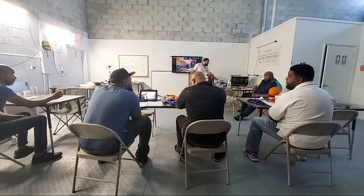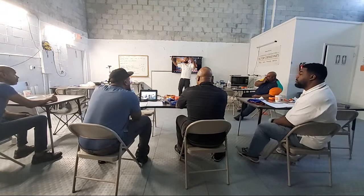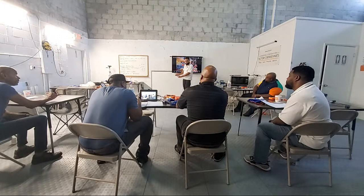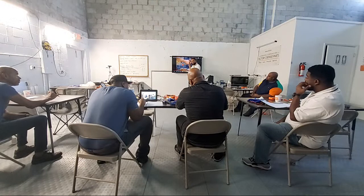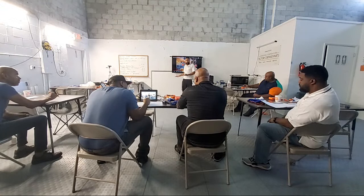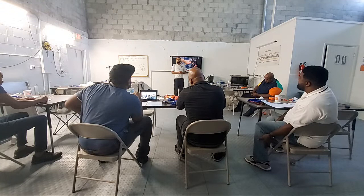We're going down a scenario, and the scenario is in a notebook, and I'm just walking you through some of the tests that we should do. We said, what are the signs if it had a defrost problem? What would it look like? We said the rear evaporator cover will be all snowy, frosty ice. And we said that air intrusion may mimic some of those signs, but it'll show a little bit more signs as well, like droplets of water on the top. You'll see frost over all of the food, that thin film of frost. You may want to check for air intrusion at that point. That's why I was showing you some of the points where air can enter the box. Did I answer your question? Yes. Okay, so we don't have a defrost. We don't have an evaporator fan.